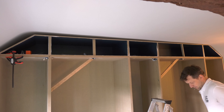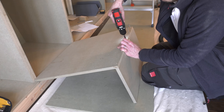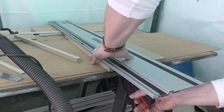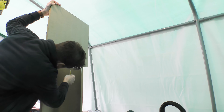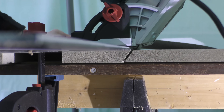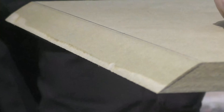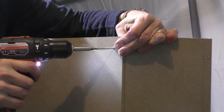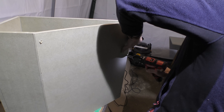The first job was to start at the right-hand side of the room where my uneven ceiling is at its lowest, to get the top box as close to the ceiling as possible, which maximises the height of the other top boxes which have to follow the dimensions of this one. The sloping section had two angles to cut — one was a straightforward plunge saw cut, but the second was too acute for the saw so the remainder had to be removed by eye with my Bosch electric planer. I then dry-fixed the box together with a combination of standard wood and Spax MDF screws.